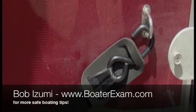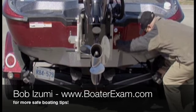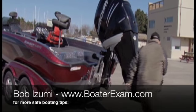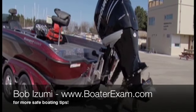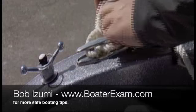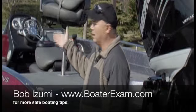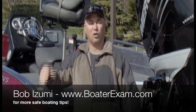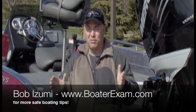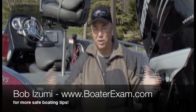Very important: taking off your straps, your transom straps, taking your motor toter off on this big Verado. Once you've got those things off, also have your dock lines in place. If you're going to back off on the right side of the dock, you want to put your dock lines on the port side of the boat, or vice versa starboard if you're going to go off on the other side. The key is to be ready with your life jacket and dock lines even before you get to the ramp so you don't tie it up.